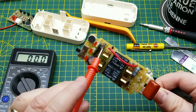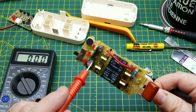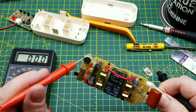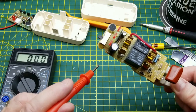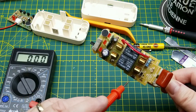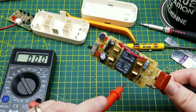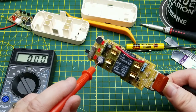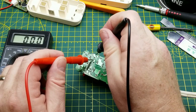That one is probably a DC block for the microphone - maybe something like that. It is an electret microphone so it's going to need some DC. At least some of these diodes - two of them are probably snubbers on the relays, so one of them may be part of the power supply. The largest cap is probably the power supply filtering cap.